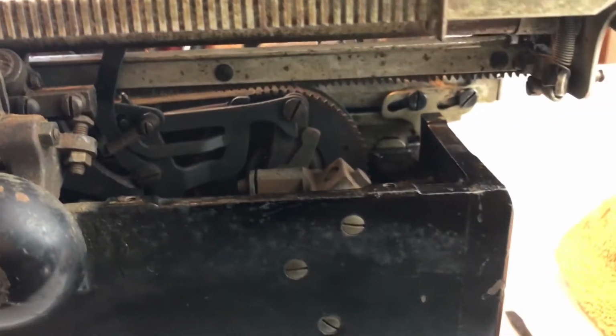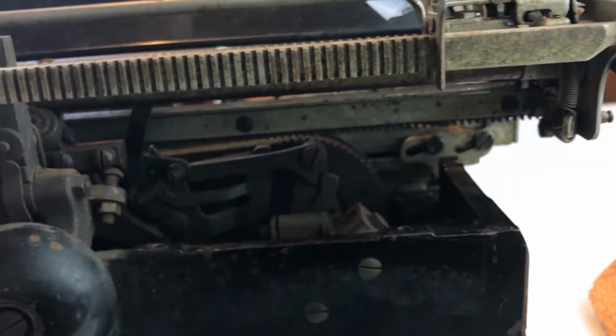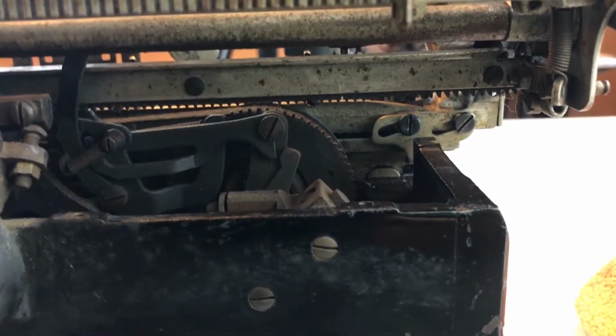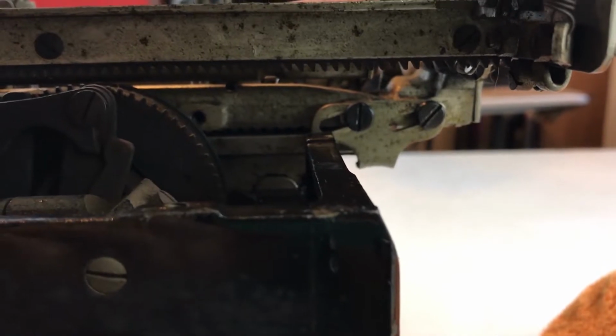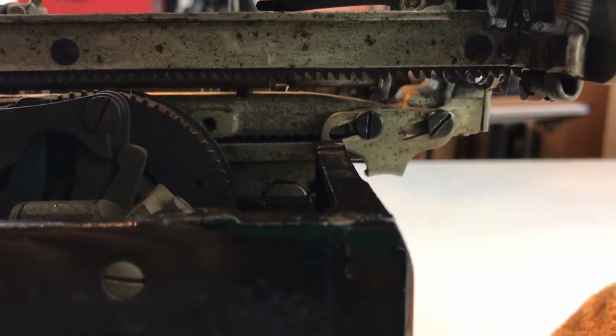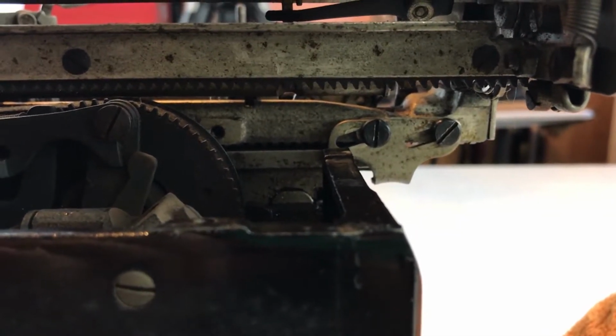And then you want to go underneath the typewriter from the back. You're looking for these little hook thingies that have screws in them. And when you move your typewriter over and margin it over, you're going to see these little clamps. These are called carriage clamps. They hook onto a rail system and they have little screws in them. There are 5 of them on your typewriter.